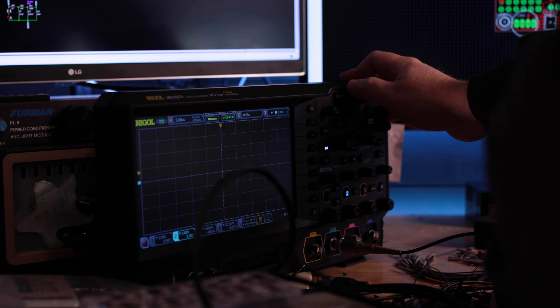The specific issue I've been dealing with is how we generate the clock signal. When I conceptually designed this pedal, I planned to have my microprocessor output a clock signal — I proved to myself it would work. But in practice, the microprocessor would start dropping some clock signals. If you're dropping a clock signal, there's a gap where the analog chip outputs nothing because there's no drill sergeant telling it how fast to march. It worked great when we left the clock signal static, but as soon as we applied a low-frequency oscillator to move it around and get that vibrato effect, it would start dropping beats. That meant I had to do a page-one rewrite of my approach.